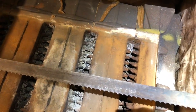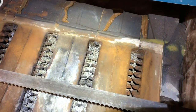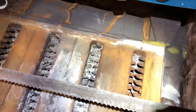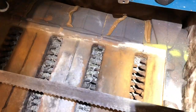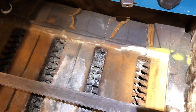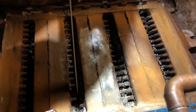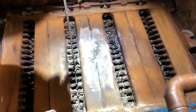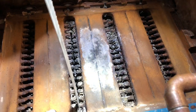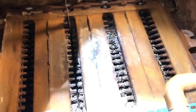If you're ever cleaning your heat exchanger, I recommend having a dust mask and a nice light. I use a shop vac with a soot vacuum bag — that seems to do the trick — and I also have the round filter inside of it. I like to start out with the saw in the center of the passages and kind of work your way up and down. This breaks loose all the soot that's blocking the path so that as you knock it out, it has a place to fall.